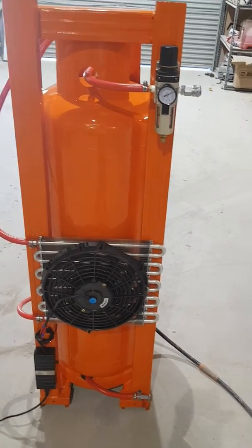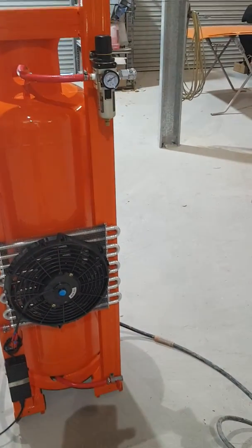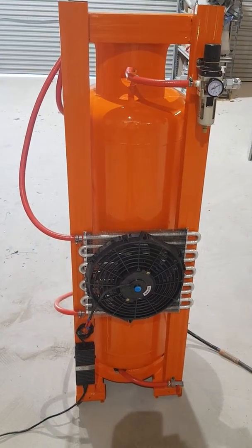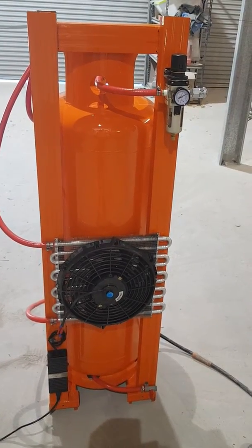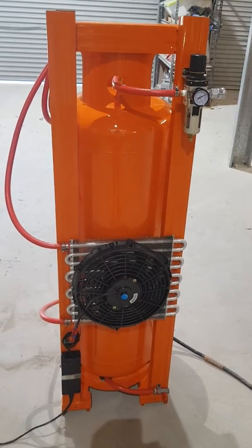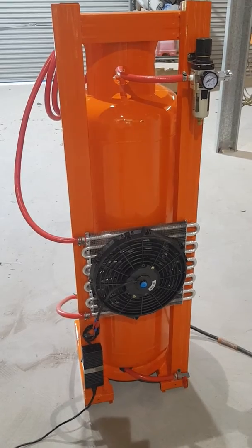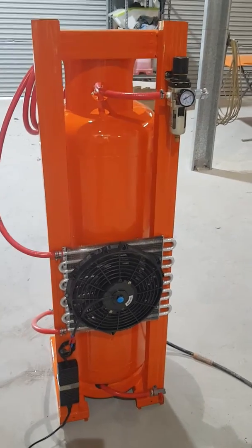Your airline is simply plugged straight into there and goes out to your gun or whatever air tool you're trying to use. The beauty of this system — and why I'd highly recommend it, especially if you're running a smaller compressor at home — is that when you're spray painting, air flow is super important. Where you pick up air flow is from volume in your system. If you're running a 50-litre tank, adding something like this — I think this is roughly 100 to 110 litres, this tank — means you get less fluctuations with the pressure at your gun. If you've got a small tank, as you use your spray gun, you'll find the pressure at the nozzle starts to drop quite quickly, especially when spraying a metallic paint, for example.